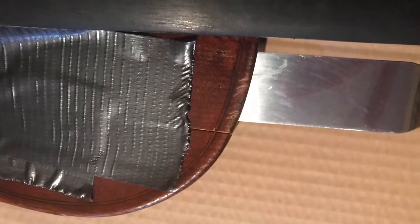I took the top off, then put cleats, and glued all the cracks. I used tape over the cracks on the top before I removed it, so that the cracks didn't widen or get worse as I tried to pry the top off, because there were at least two or three very large cracks through the top.